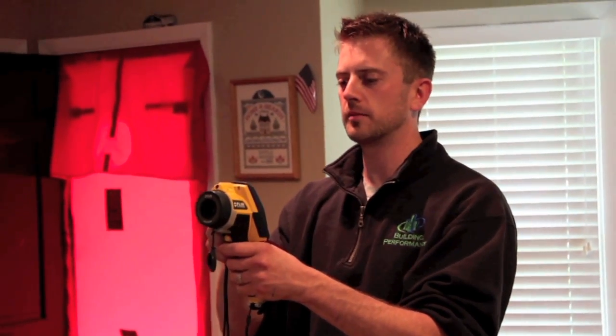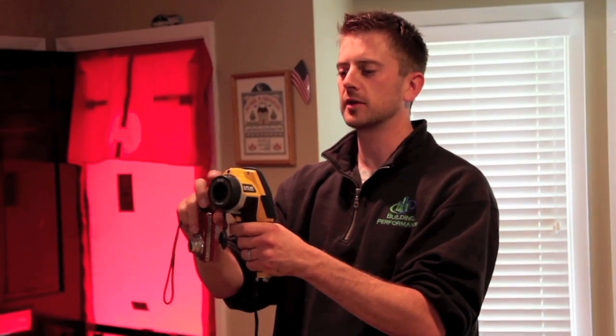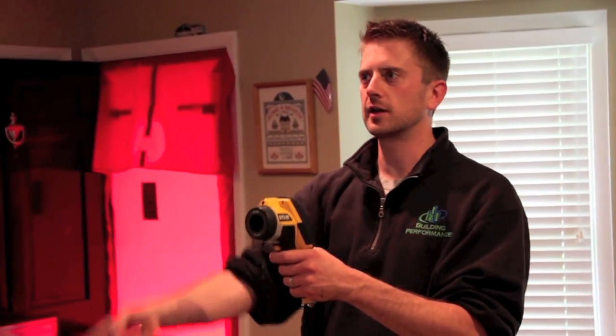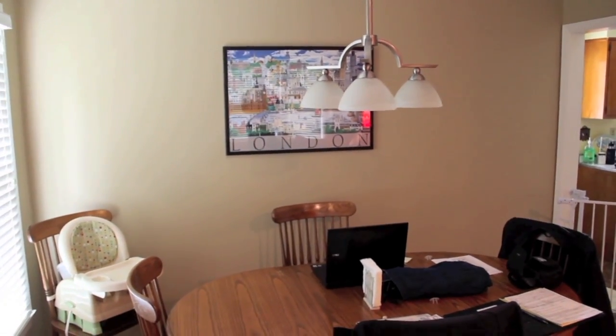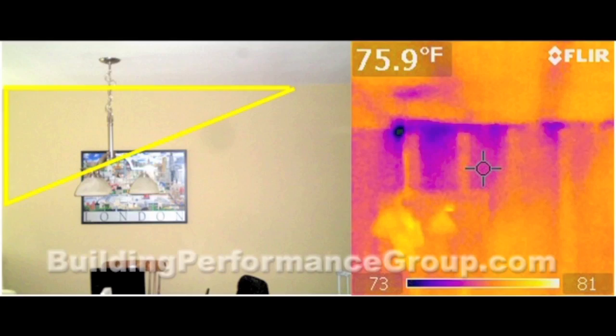Along the wall that goes down to the basement, you've got your staircase going downstairs, and it looks like part of the ceiling is open to the attic, and those wall cavities are open to the attic above. You can't see it with the naked eye, but the infrared camera shows a lot of air movement right there. You can see it's much darker up there, and if we stand back further, this whole line goes at an angle along with how the ceiling slopes down — indicating missing insulation or a lack of blocking in the attic.